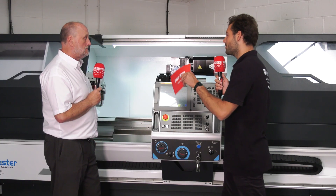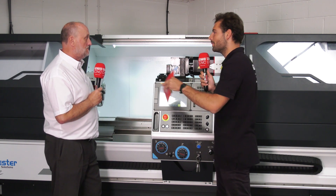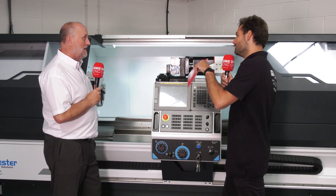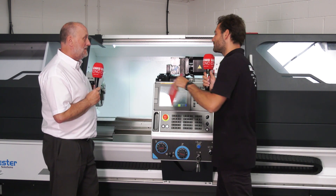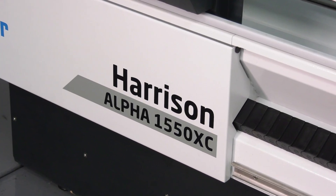I've never seen a three-axis lathe in this kind of configuration — with the robust Colchester two-axis manual winding-the-handles design. But what does that extra third axis allow you to make? It gives you your first form of automation. You don't have to take the job off to do any milling operations. You can do drilling and milling, both axial and radial, without removing the part.